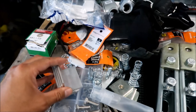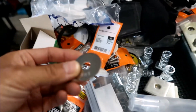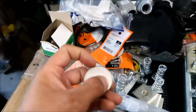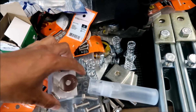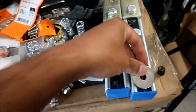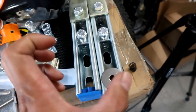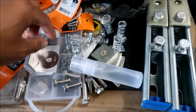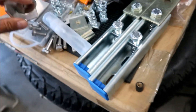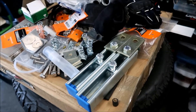I made the four end brackets we're going to need — I haven't drilled the holes yet. I got the right washers this time because last time I got the wrong ones. What we do is grind and flatten the bracket a little bit so the washer fits in there perfectly, then drill a hole right there. The washer needs to be the right size — last time it was too small and it was crushing the bracket during installation. I made it a little wider this time, which is fine.